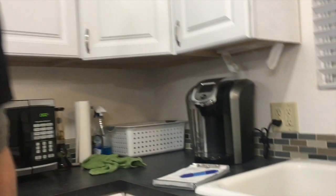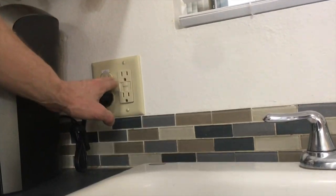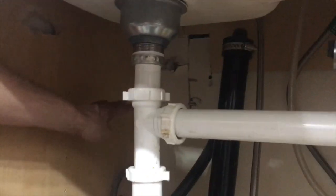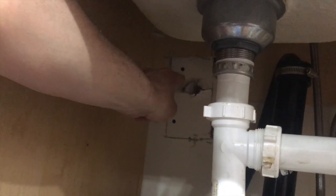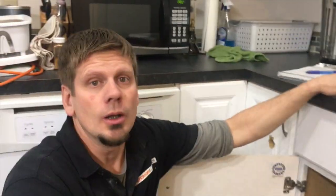I came out to diagnose first. We had a switch right here with no GFCI protection. As I traced out that switch through the wire, there are three 2x4s right here holding up that window in this wall, and the bullet shot right through perfectly. You can see it came through here — it was a 9mm — and it shot perfectly through the wire. It was a 14-2; for you electricians, it was just called a switch loop.